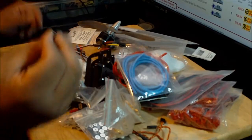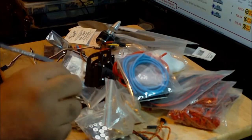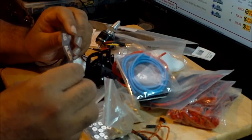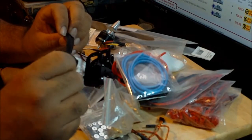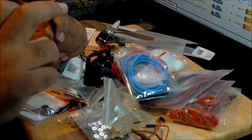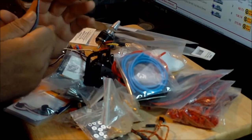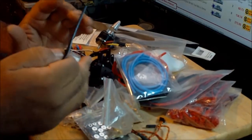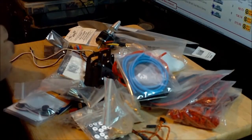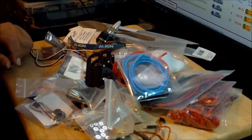These straps that I have over here are like the battery straps used on the small 450, 250 RC helicopters. These ones are used to strap the video transmitter onto the aircraft. I mount the video transmitter with Velcro onto the aircraft, but I strap it at the same time. I want to double secure everything, so that nothing comes off and falls off of the aircraft.